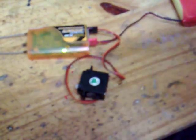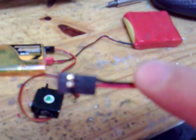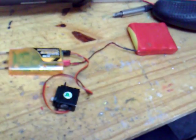Hope that clears up everything for you guys about this receiver. One thing that's worth mentioning is that I did try the tip from Hobbyking in order to parallel these two receivers into one 14-channel receiver. So I made this jumper from a Futaba wire that's curled back in the ends, and it actually does not work. So I think that this model of Orange receiver does not have this function. From what I can read on forums online, people have all had the same results. So I think that it would be best to disregard that tip.